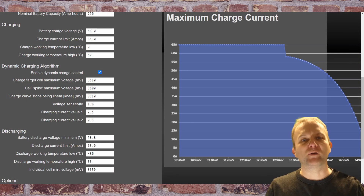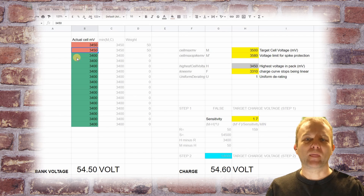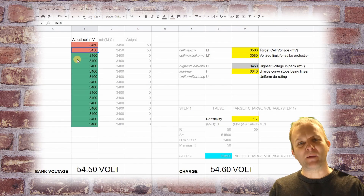I've been running this setup on my own battery for several weeks now. What I've done is use the values on screen along with setting the cell modules to begin passive balancing at 3.45 volts. So when the first cell in my battery charges up near 3.5 volts, charging will slow or stop at this point, but the passive balancing will have already kicked in, bringing that high cell voltage down to 3.45 volts. This then allows the charge to continue until the next cell goes near the limit. Doing this on every charge balances the cell voltages across the battery, but it does take a long period of time.